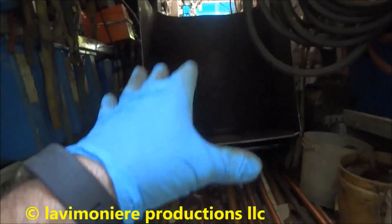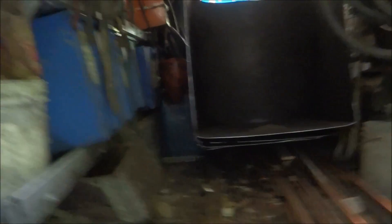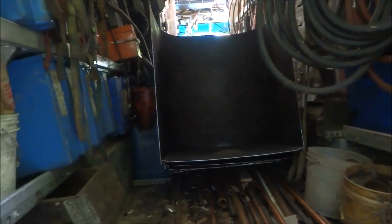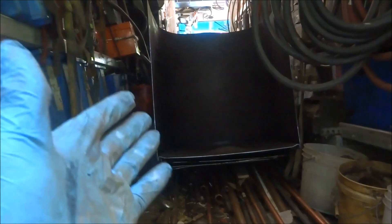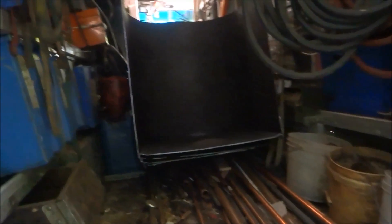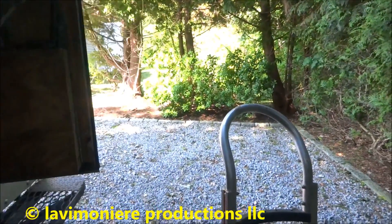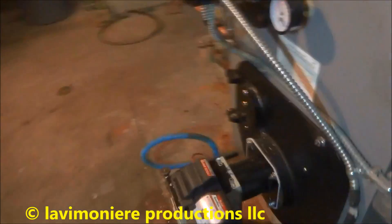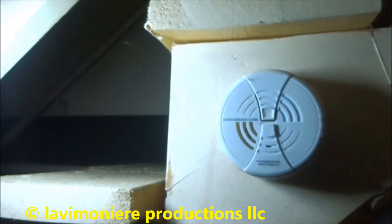The guy wanted these oil tanks changed and wanted the boiler changed — he called me to do the job. They weren't leaking as far as I could see, but the boiler's 25 years old and the tanks are 25 years old — they should be changed at this time. Some people let them go 40 or 50 years and they start leaking. This is when you want to change them before they get bad. Now he's got brand new tanks and a brand new boiler, good for another 25 years. I got the place all picked up, put the date on the boiler I installed, did a combustion test on it, and put a carbon monoxide detector.